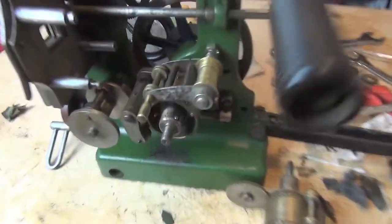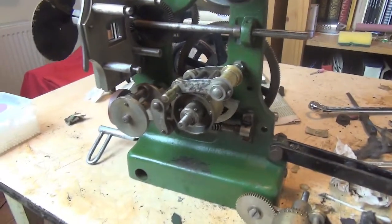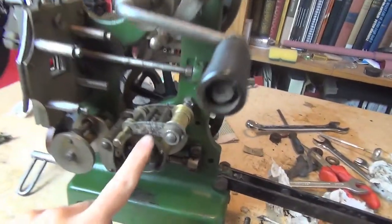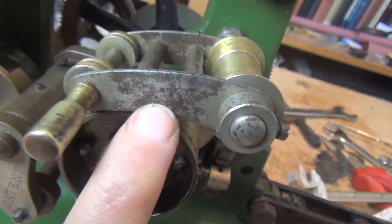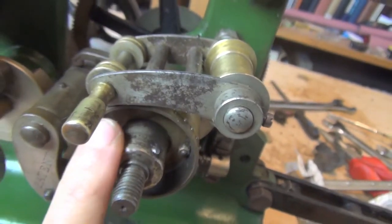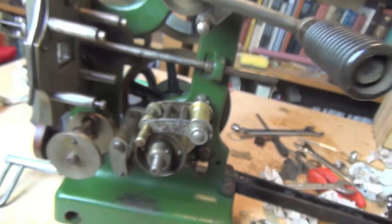After that's been done and the lens unit reassembled and thoroughly cleaned up, the cleanup is about 80% done. We've got a nickel-plated piece here and what I'm going to do is dunk that in vinegar until hopefully the rust will disappear and it'll look a lot better, but I'm not scraping the nickel pieces too much — obviously we'd lose the nickel.